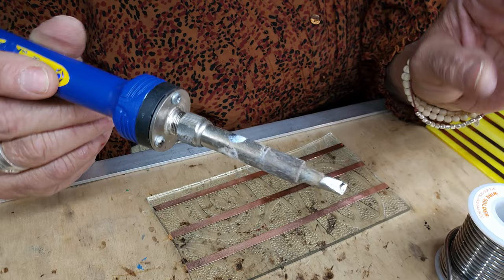I'm going to take a pair of my pliers — these are needle nose with a bend. There are no teeth in here. The teeth is what mars the wire. We don't want to mar the wire up at all. These are jeweler's pliers — you can get those at Hobby Lobby. And as you can see, this wire is already curved. So I'm just going to basically — no jig now — all I do is kind of just pull it around. I use my fingers and I just keep twisting. Come up a little bit, twist a little bit more. And you can see the wire did most of it. All I did was give it a little help with a little bit of turning of my pliers. I got a nice big curl. I can cut this off right here. Now I got an open end curl.